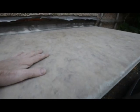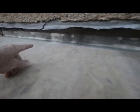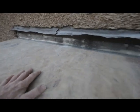Right, that's all sanded down now, so that's our finish ready for the resin, the top coat. There are a few places where we got bubbles, tiny little bubbles, being my first go at fiberglassing. You see there's a few dry places at the back where I didn't manage to slop the resin up there. So this is a DIY version of what can go wrong, things you want to improve on second time.